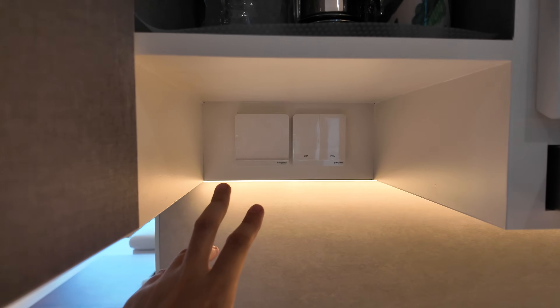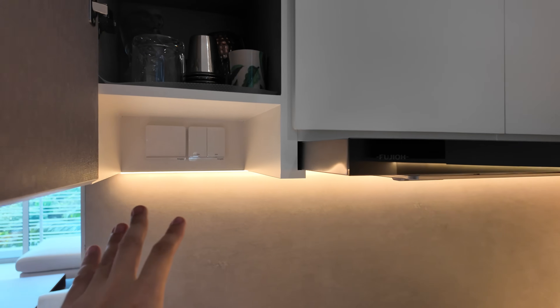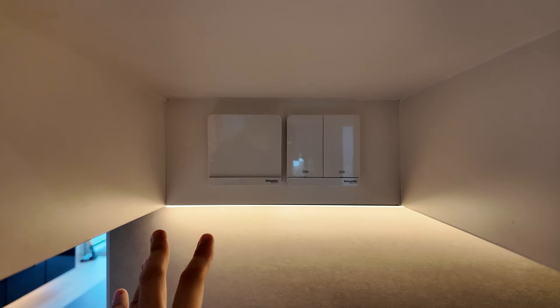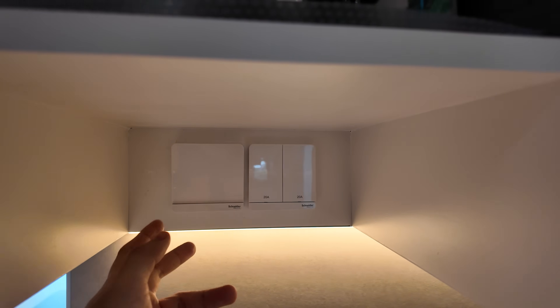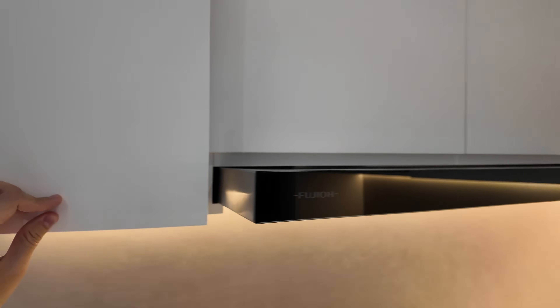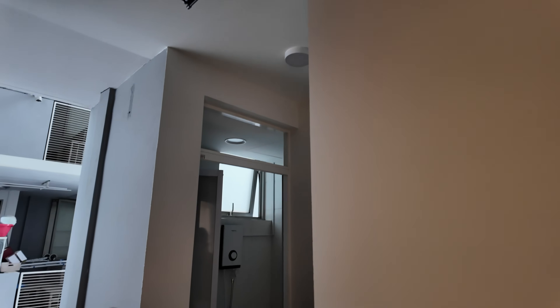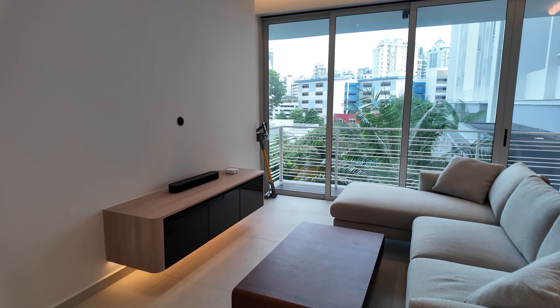It's just this smart LED light strip here, which is the Aqara one, and the switches are hidden. As I always mention to clients: if it's a light you won't intentionally switch on and off, it's best to hide the switches — which means you don't need to install a smart switch. You can see this is a very normal Schneider Electric switch. Because it's the Aqara dimmer it's already smart, so you tie it to a normal switch. In this way you save cost by only buying smart switches where needed. This is the kitchen area; the laundry area has no smart devices — just the Stegen drying rack and bomb shelter.